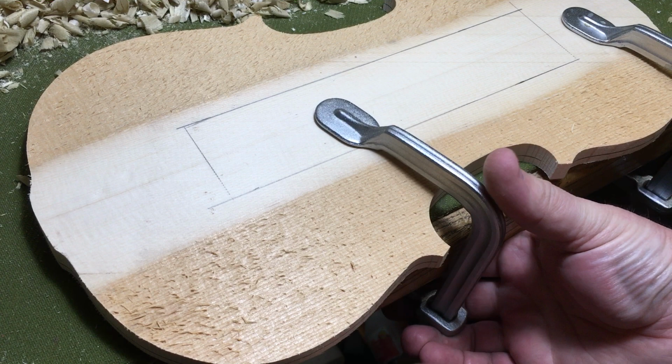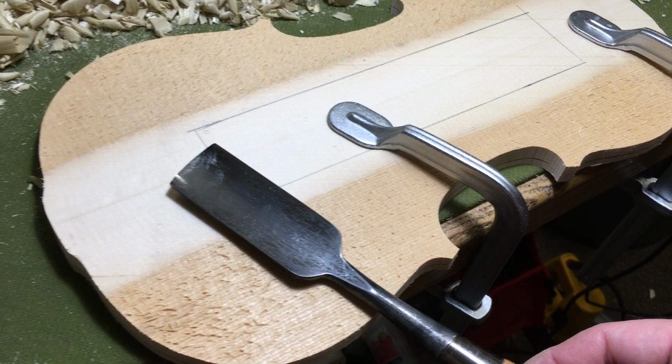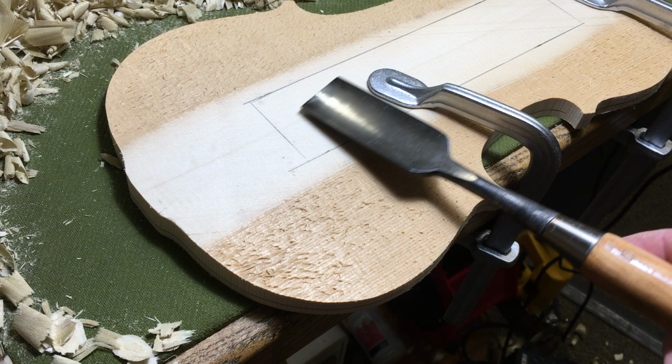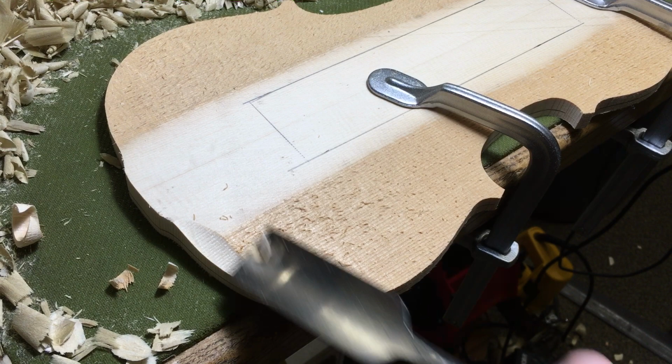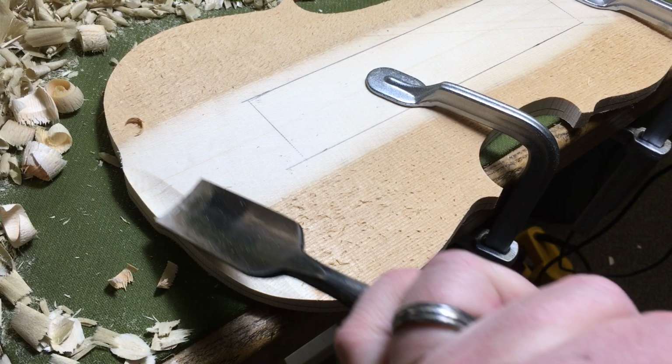So I'm going to start carving down this area here. I'll actually start with a gouge. This is a Japanese gouge. Move you one more time so I get in a little better. There we go. From right here, I have a bunch of extra thickness because this is flat right now. It's hard to see in the video, but this is completely flat all the way across. And this bottom part has to go down to the edge. So I'm going to start off by taking a gouge here. I'm going to change hands. I'm just going to carve away